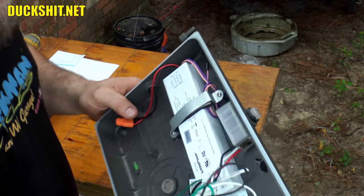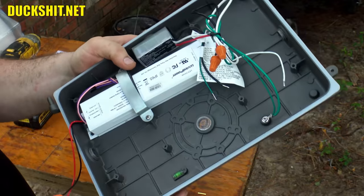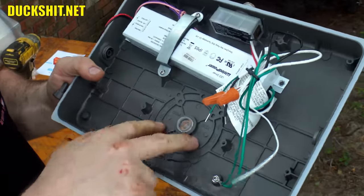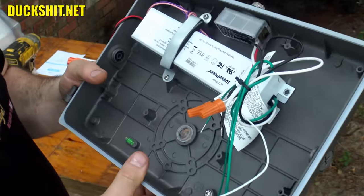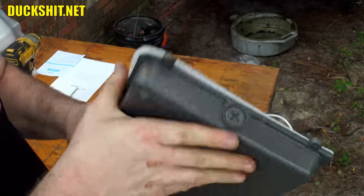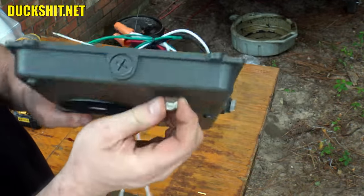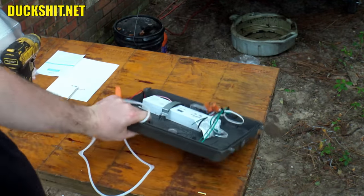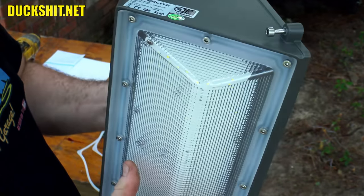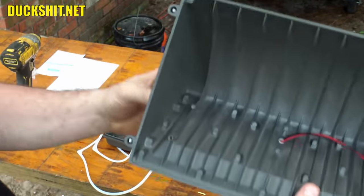Since of course you're not going to need the light during the day. As far as mounting is concerned, it looks like we have no mounting holes or mechanisms — it looks like everything we have to do is drill out our own. I think I know where we're going to mount it, so what we're going to do is drill to the same width as my lag anchors that I have in the mortar between the bricks here at home, and we'll get it mounted up where I used to have a sconce. It looks like a pretty robust unit. It's not plastic — it is metal. It's not magnetic except for where the screws are at, so it's probably either some kind of alloy or perhaps zinc, a.k.a. pot metal. Nonetheless, it's a nice cast piece. It's not some formed sheet metal garbage. It's actually a really nice component.